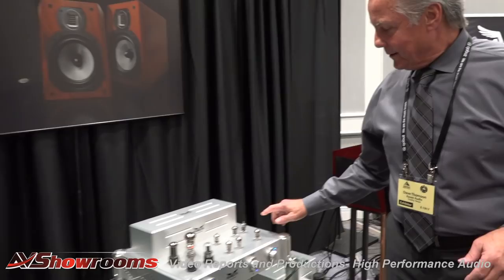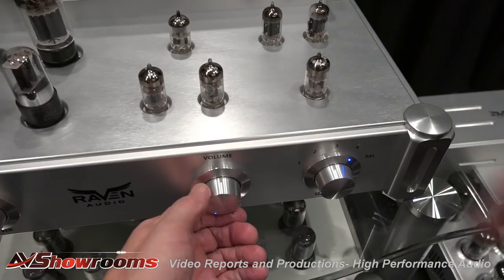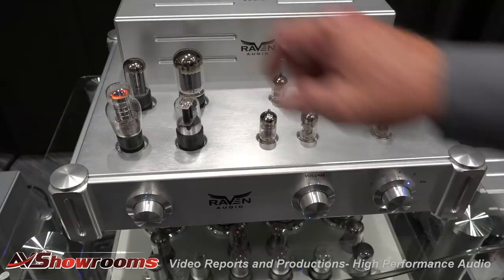Okay. And we're using our flagship preamplifier, which has a built-in phono stage, 47K, so it's good for high output cartridges. And then this is the line stage here. It's tube rectified, tube regulated. This is an OA3 regulator from the 40s. And this is the rectification here. It's 5Y3, 6B4G. This is an old 6SN7. Most audio people are familiar with that too.